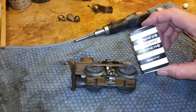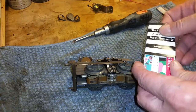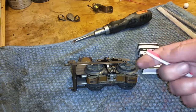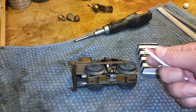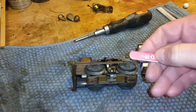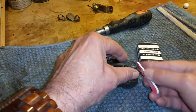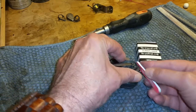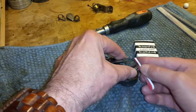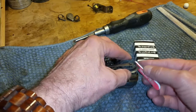What I use for this are these — I found them at the dollar store. They're little tiny disposable emery boards. They don't leave any great amount of residue and they're fairly rough — about 400 grit sandpaper or so. They're made for filing nails and they file them really quickly. These are perfect for touching up the edges of these wheels. Whenever you see electrolysis and intergranular degeneration and the wheel is beginning to get notched or ragged on the edge, all you have to do is go around it a few times with this emery board.